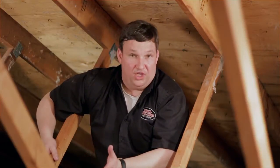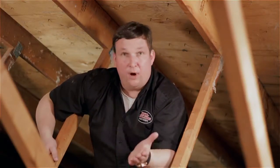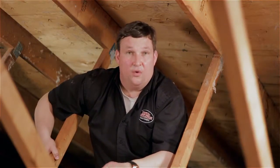So my belief is, if you want the job done right, do the whole attic deck. Suck it all out, spray the entire attic deck, and that way our field managers can check out the job and make sure it's totally sealed. Homeowners and contractors can go into the attic and take a look to make sure the job's done right. When somebody promises you to go into an attic, push the insulation away, and air seal it — think twice. That job never gets done right.